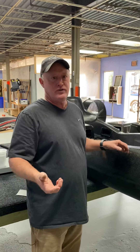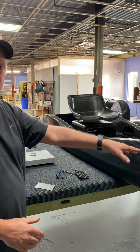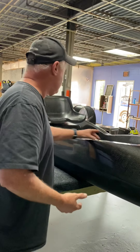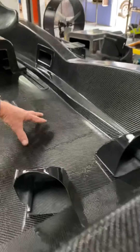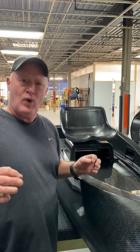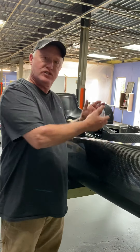The next thing is we come in and do our layups. Each layup is very specific in the order and the way that we do it. We spend a tremendous amount of time with very accurate patterns cut to fit every part of this boat. From each bond line up is a very specific pattern — that allows us to control the weight of the boat very consistently. By not having big or small overlaps, we keep consistency throughout. In the bottom of the boat, we use a core material — a quarter-inch H45 core. Because of the weight concerns, we're not actually infusing the core in place; we're secondary bonding them in order to keep the weight down and get the stiffness back.